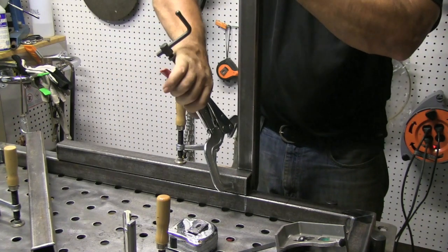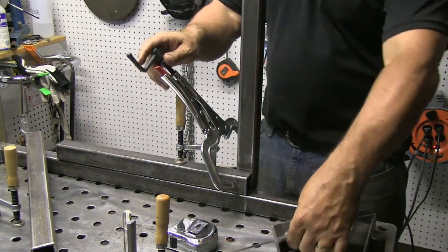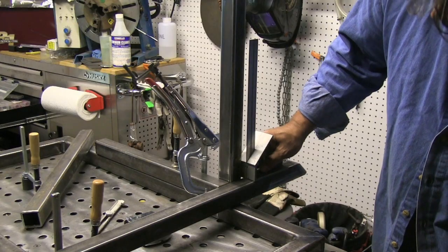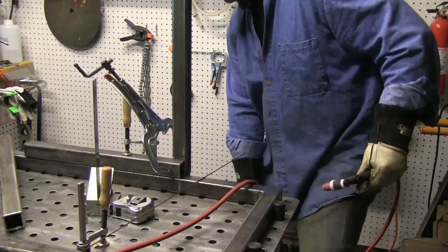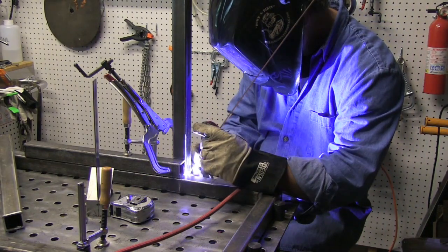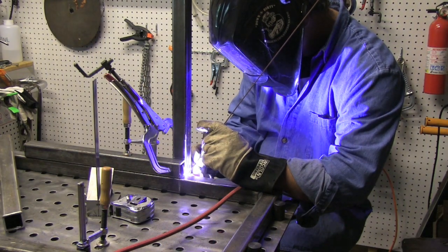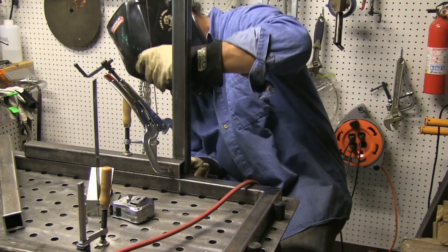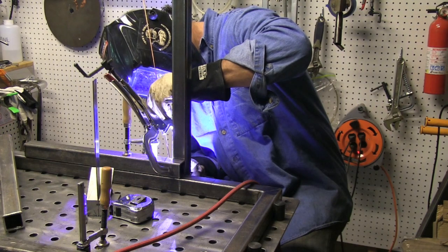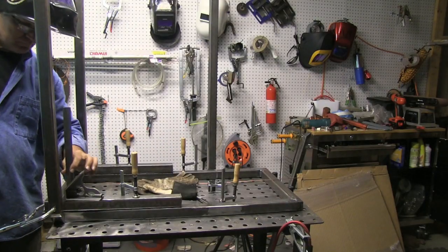I've got a mark about 10 inches inboard, which gives me room to put two cylinders on the back of the cart. I'll get it square one way first, then lay a piece of scrap the other way to square off that before the first tack. It doesn't have to be perfect before the first tack, but it has to be square one way. Then I'll get two tacks, square it the other way, get at least one more tack, and do the same on the other three pieces.